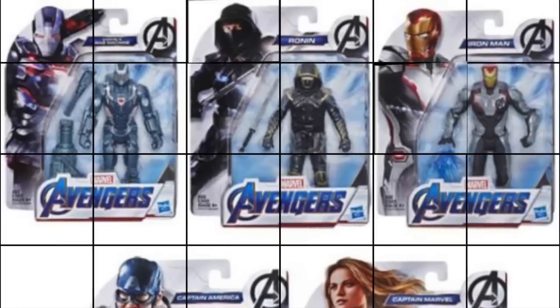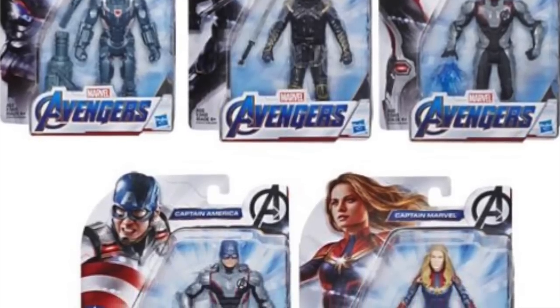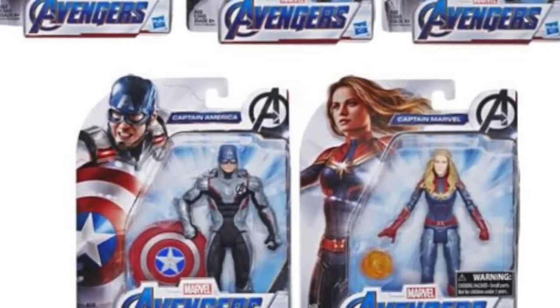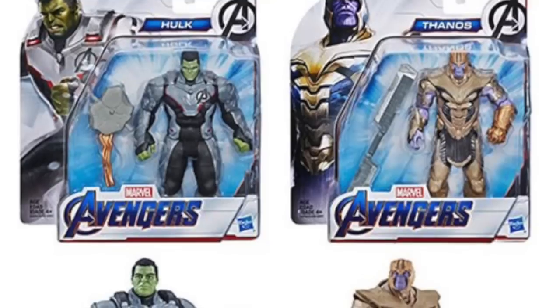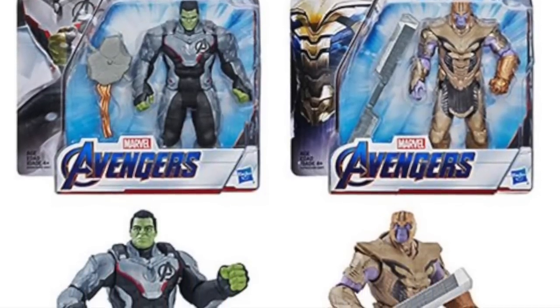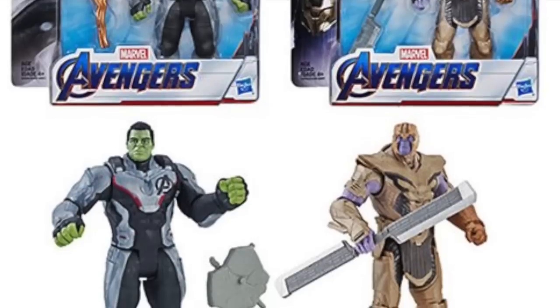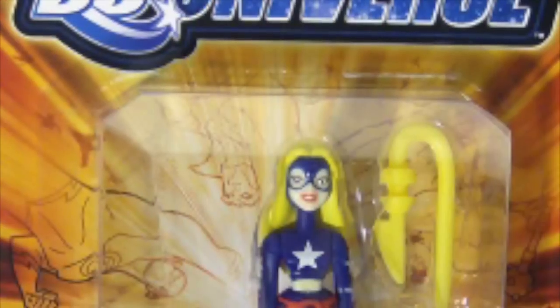Then of course there's the type of material being injected. For most toys you're dealing with plastic, which is either ABS or PVC — different types with different flexibility. Capes are usually made out of PVC. And then you have movie lines that sometimes need such a huge number of production units for retail that they'll get what's called double tooling — meaning a character is tooled twice so you can run two machines simultaneously to meet your sales quota. This happens a lot with major blockbusters like Avengers movies or Star Wars.